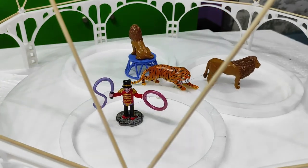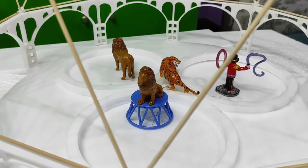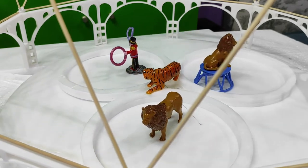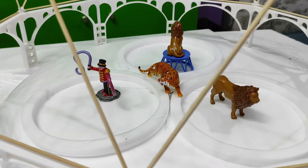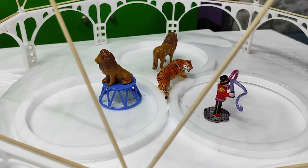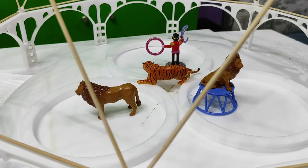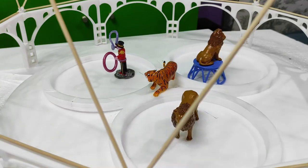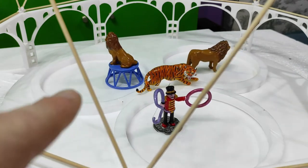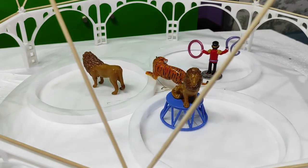And the under dome. Like that, guys. Sorry. But I was saying right now that it will be very important to have the same weight inside the three rings. Otherwise, one will tend to go down, and you will have everything imbalanced, and so I will get some frictions with the platform going up once, down once, up, etc. Now it is perfectly balanced, so it will turn.